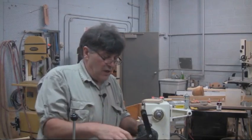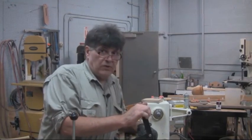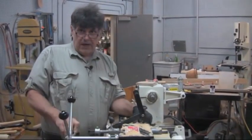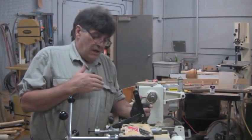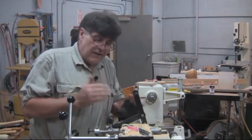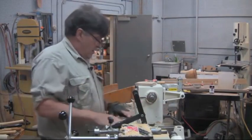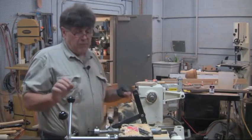Again, what you don't want to do is let your cutter slam in. You want to take slow, easy passes. And again, I'm going to say this one more time. You saw this thing putting out a lot of dust and dirt. To keep your track clean, use a little something to blow it off.